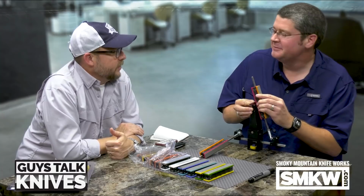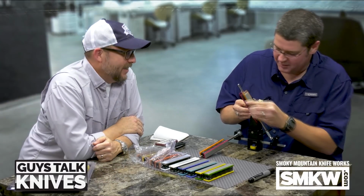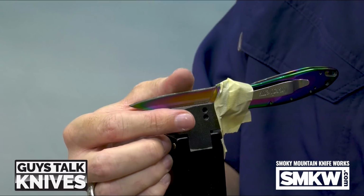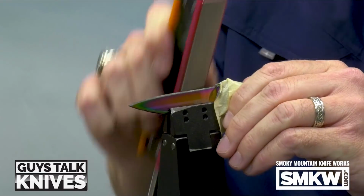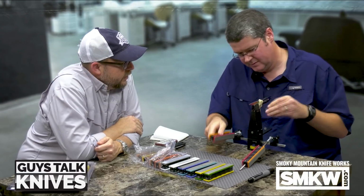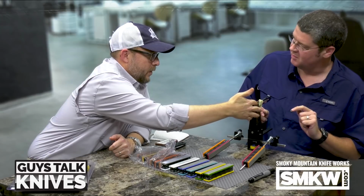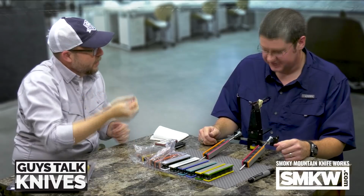Well, I didn't miss it. Come on. So what I'm going to do, go back, and I'm concentrating on those areas where I did not get the burr. That's good on that side. And that's good. If you reach over to this side, feel that burr? Oh, yeah. Feels like a little hair or a little wiggle as you come up across the blade.